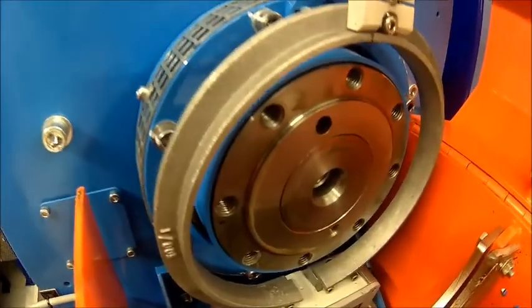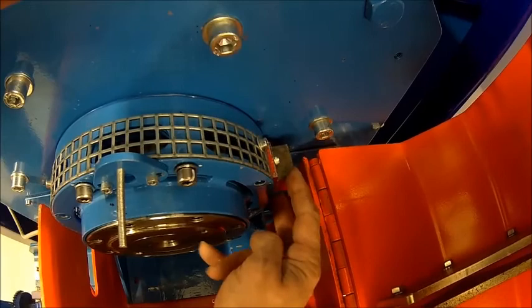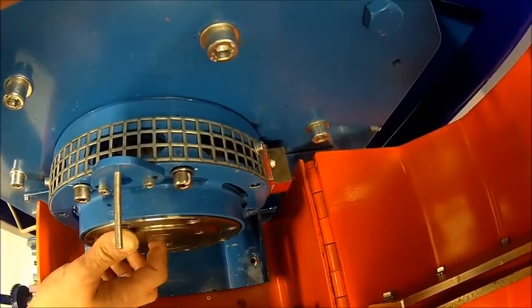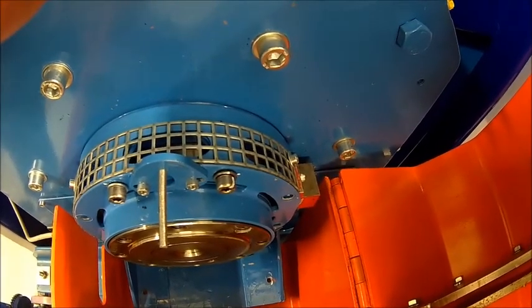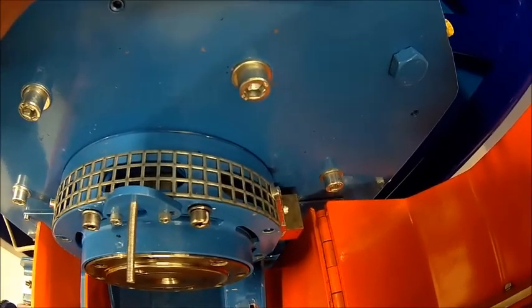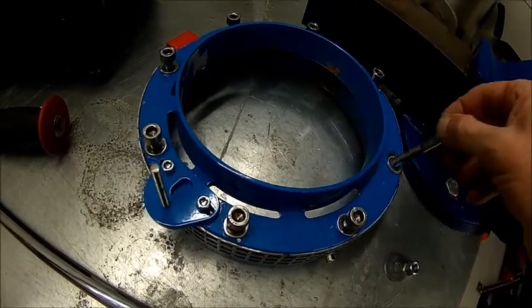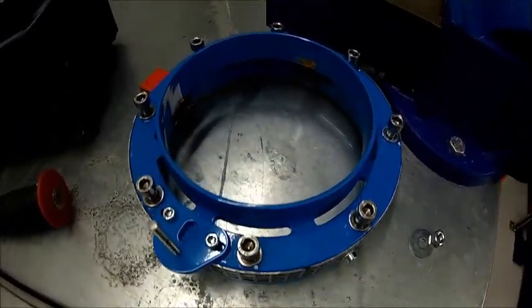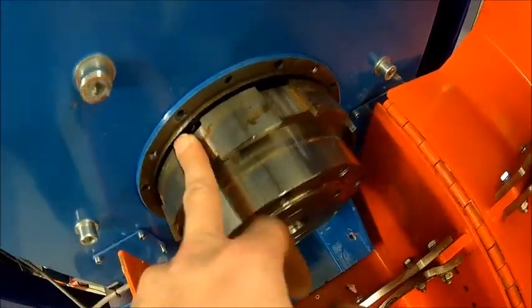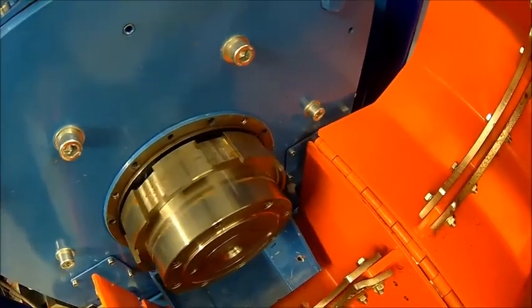Let's get these parts off and check them out. There's a little block here held with two allen screws that you can take out, turn around, and slot into a slot in the rotor. Put the bolts back in and the rotor is locked — useful for tightening bolts, checking the torque flange, or similar tasks. The reason they're red is so you can see whether it's fitted or not. Here you can see the hole for this locking piece. Those bolts were Loctited in, so they need a bit of a clean and new Loctite to refit. These are the slots where it goes in — equally distributed to ensure balance — so you can easily lock the rotor.